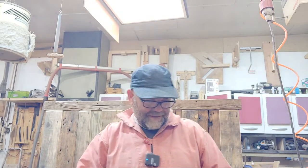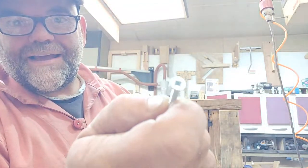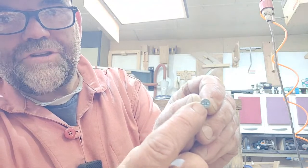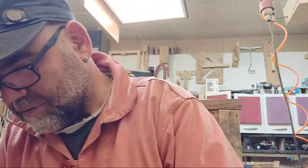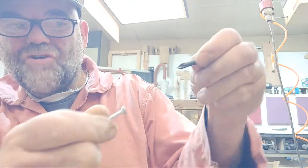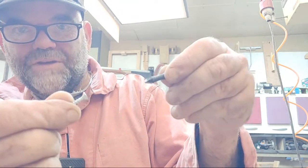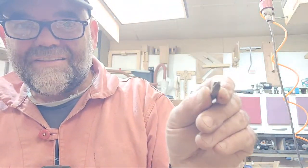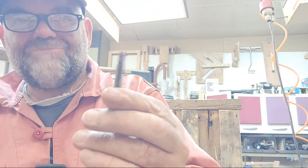Now, while I'm going on about screws, I get a little bit frustrated. I do. Tell the missus. I'll ask the missus. The reason I get a bit frustrated is when people borrow my screwdrivers and use the wrong bits. They get confused between Phillips and Posidrive. Now, a Posidrive screw, I don't know if you can see it on there, has these extra little bits. It's like a star almost. The actual wings, or the little slots, are wider than the Phillips, so a Phillips screwdriver bit doesn't fit properly. This is a Posidrive, a worn one, and it goes into this screw and fits perfectly well, so it doesn't ride out. You only get a load of noise, it doesn't ride out so much. Whereas if you had a Phillips, which is, that is a Phillips, it looks the same, but it's not. The wings are thinner on a Phillips. This is the old type of screw.